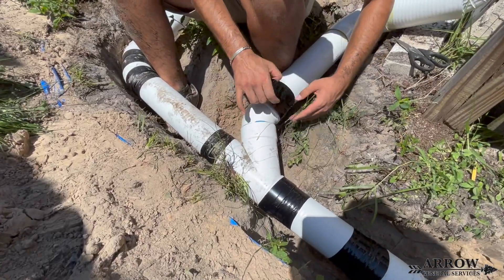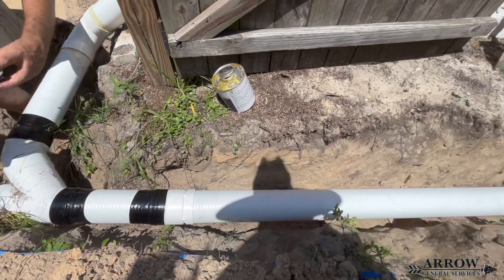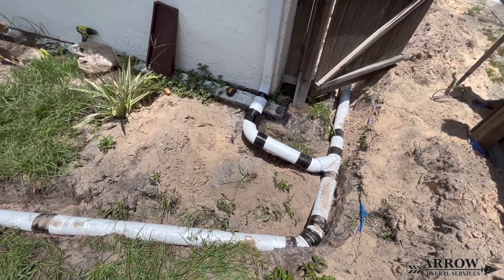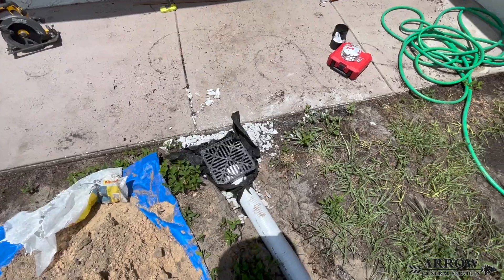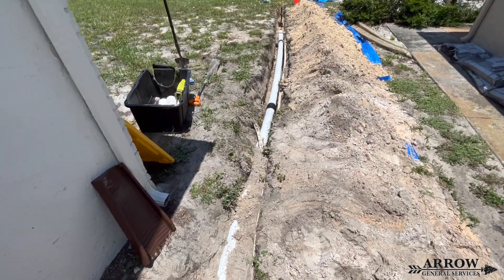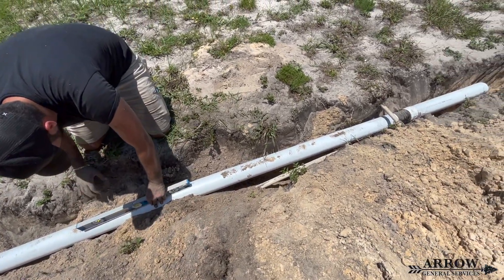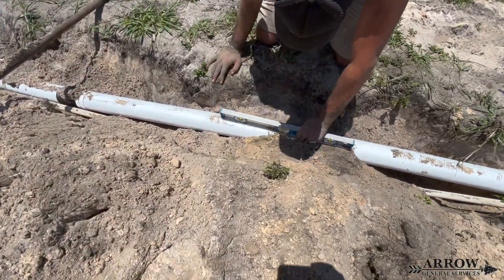This pipe is designed so that it can fit right into normal sewer fittings — the same ones we use with SDR-35 PVC pipe. A tip on installing this HDPE drainage pipe: while you are laying it into your trench, constantly take the level of it. As you create the joints, start to bury it in and pack dirt around the sides, and check your level continuously. Because this HDPE pipe is slightly flexible, it can throw off your level if you're not packing dirt around it. So bury it as you go and constantly check your level to make sure you're on point.